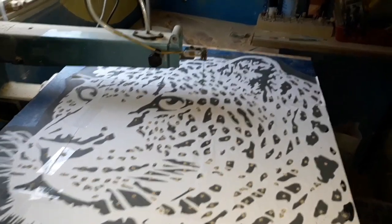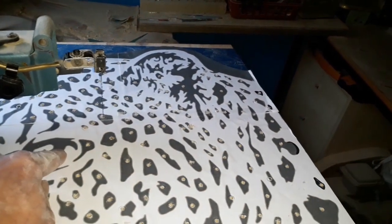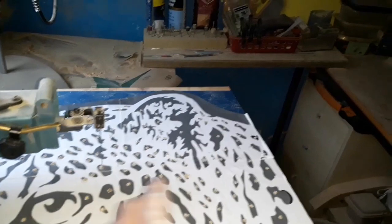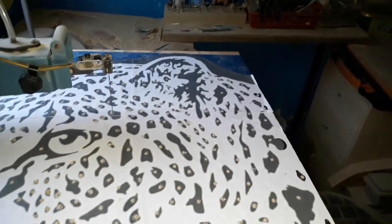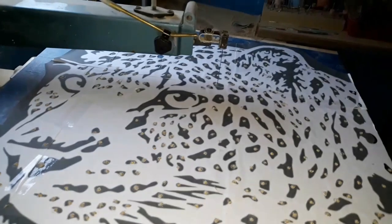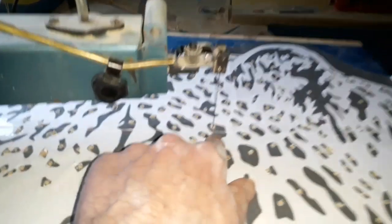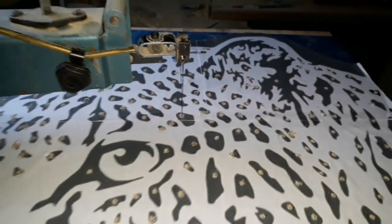That's with straight blades. Whereas with spiral blades, you could have your 16 thick. You could turn it round and do 16 on this side, if that makes sense. So basically 30 inches plus is a piece, and ours is 26, was it 28? I don't know. With spiral blades, we can just feed it across like that, going from left to right, up and down, to take out our little section there. So spiral blade for sure.